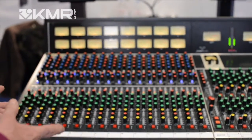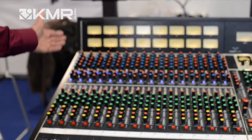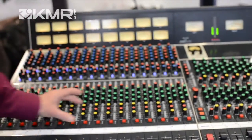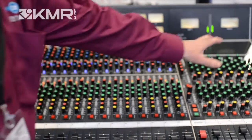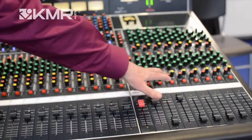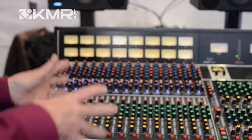This console offers 48 channels of balanced line inputs. That's made from 16 standard channels, each with 2 inputs — mic or line. We have a separate 16 channel monitor section, so it's in-line, but we also have 8 buses and a separate monitor section. That gives you 8 returns for the subgroups plus another 8 channels of monitoring — so 48 balanced line inputs in total.